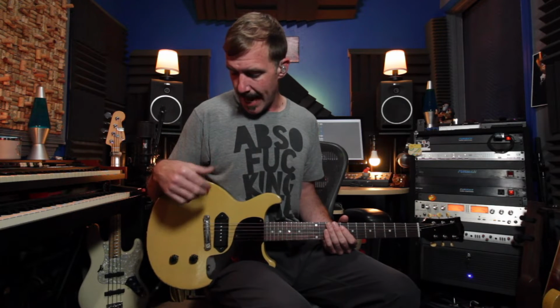So we basically have about a 10 or 15 dB reduction in noise, which might not sound like a lot, but it's actually pretty considerable. 6 dB is basically double. So if you turn something up by 6 dB, it's now twice as loud as it was before. So something like 10, 12, or 15 dB is a pretty significant reduction.